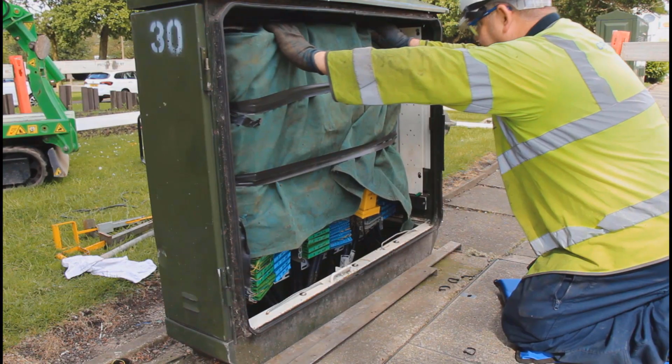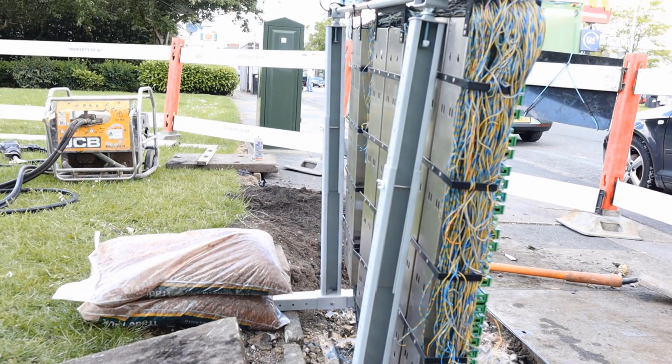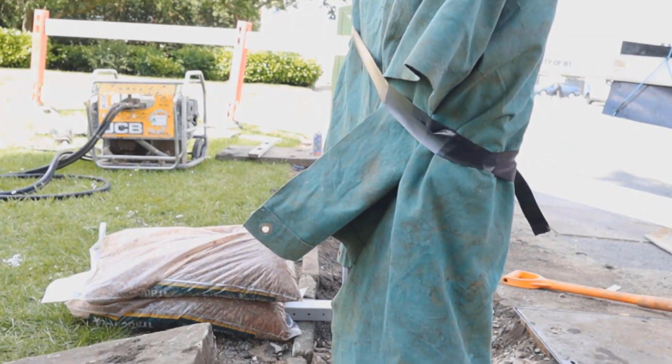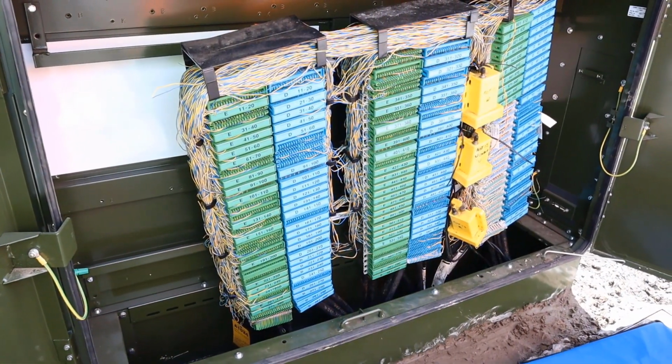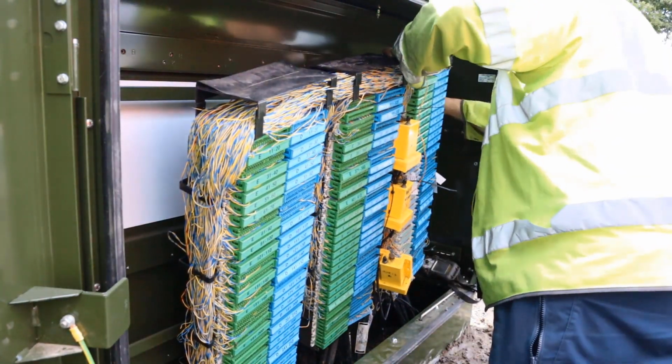Once the old shell is removed, the verts must be supported. This is done using the PCP connection support frame. It must then be resheeted and re-protected. With the new shell in place, the rehanging can now proceed. The assemblies are reattached in reverse order to detachment.